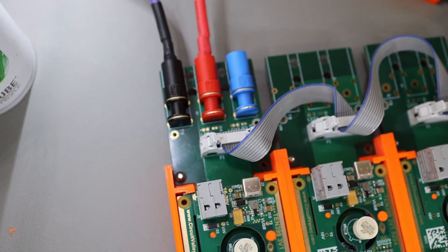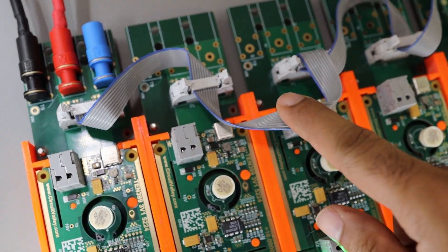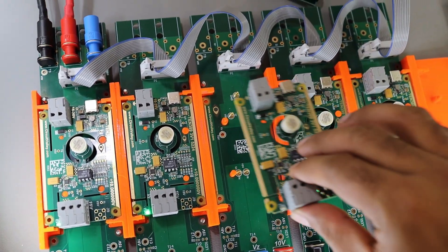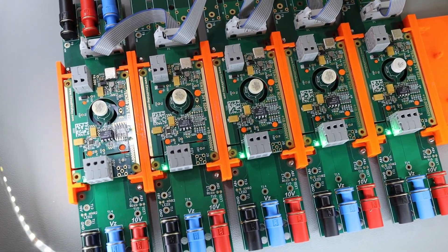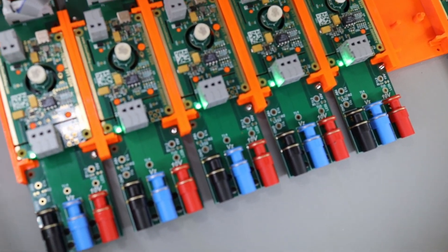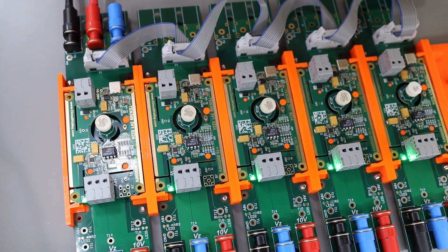The boards are sharing the power using a ribbon cable. Because banana connectors are quite expensive, and if you have multiple banana connectors you will also need multiple banana cables. So I have made this IDC cable that goes through all of the connectors and supplies power to all of the boards. If you want to plug in or take out a board, you can easily do so — very easily. You can even do it while it's running, because the test pads are so well placed that they don't mind all that much. So this is my test setup for aging and testing these boards for multiple weeks. It involves only one small 3D printed part, and you can easily have this kind of contraption and test your board.